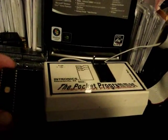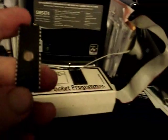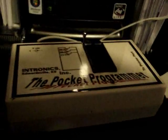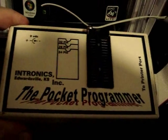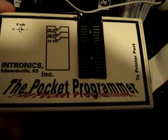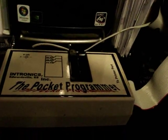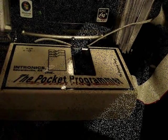We just got a new batch of EEPROMs and had to order them on eBay. These are 27C4001s and we have the pocket programmer, which is the older version — not the pocket programmer 2, but the first version they had. It hooks up to the parallel printer port of my computer, but it works well so I haven't seen a need to update it.